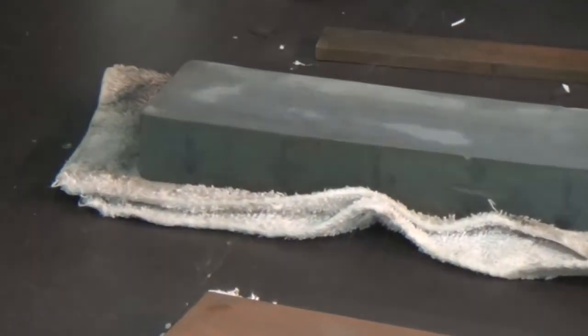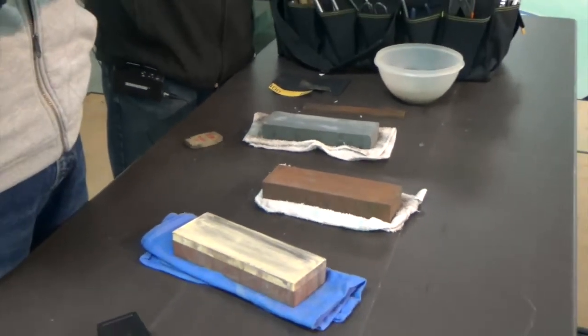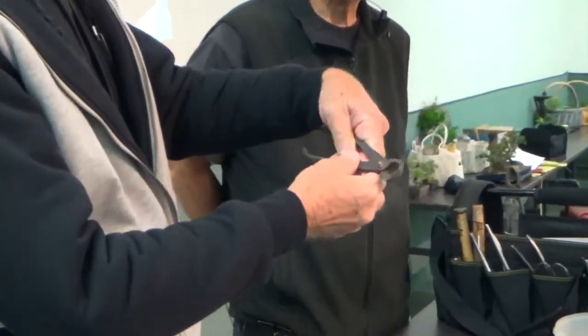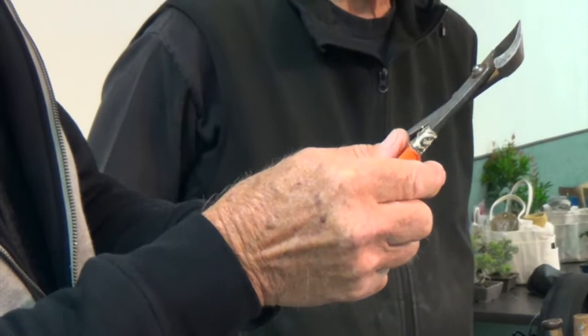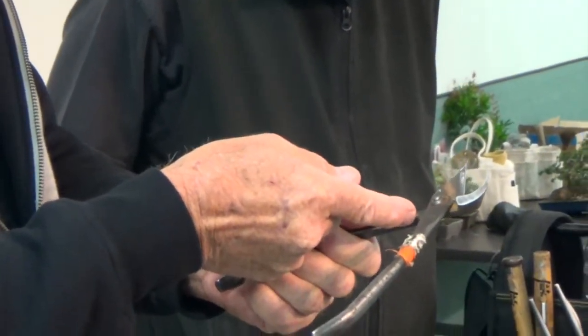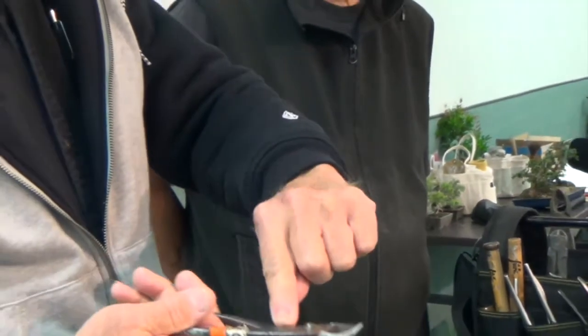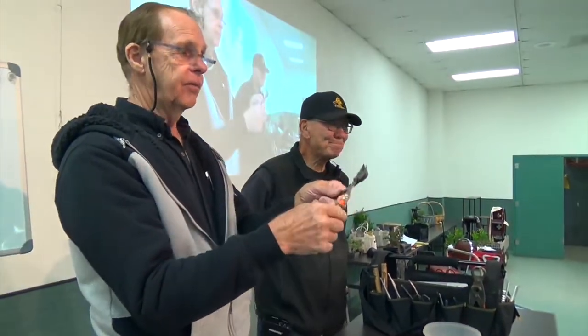After you've had your tools for a long time, they may not meet in the center anymore. There's a little pivot pin on the scissors. You can either file a small spot with a round file so it closes more, or take a little bit off the pin - either way works. If you look at the scissors up to the light and see light all the way through, that means the pin is touching the opposite blade and the tips aren't closing. That's what you need to fix.